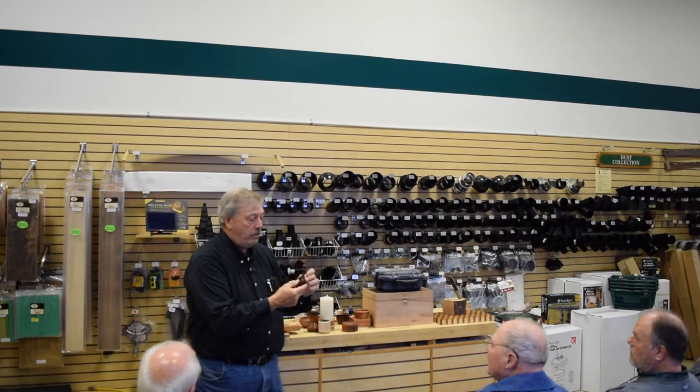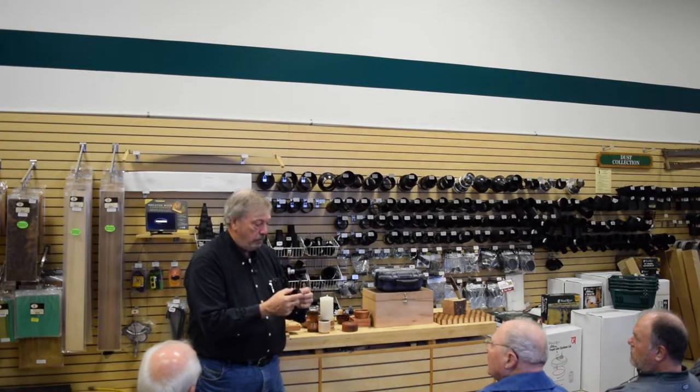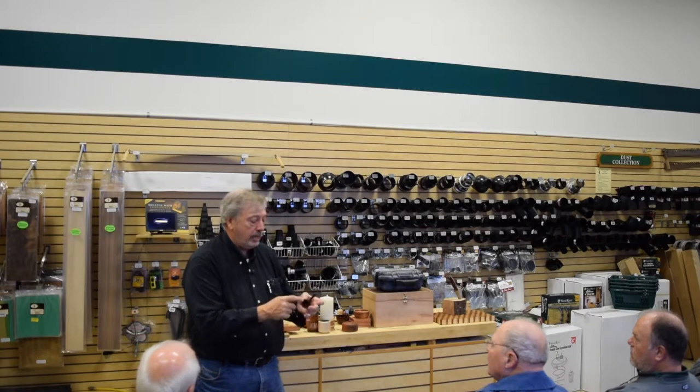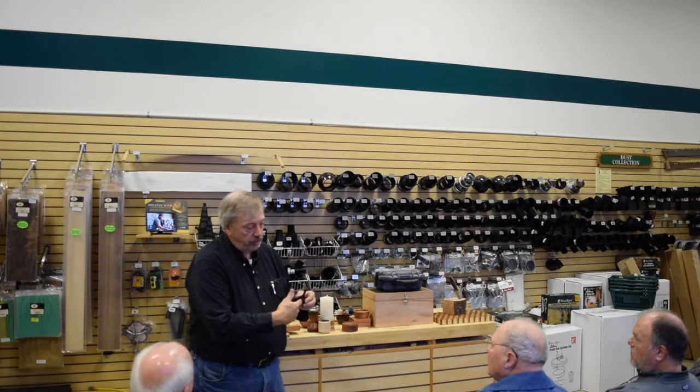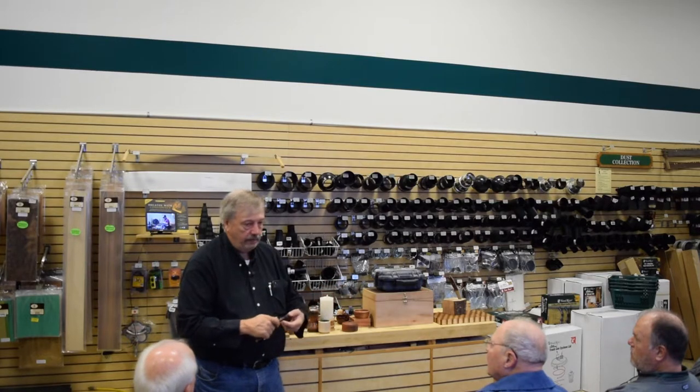Then when you take it out, you're going to make what's called a jam chuck. And a jam chuck is going to be so I can press this ball in there, and it's kind of hold it in place. But I also cut a groove for this. Stick it in there, and I just turn this out. Voila, I have a little scoop.